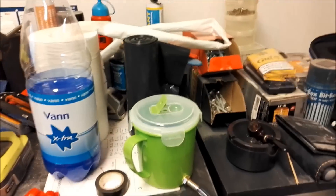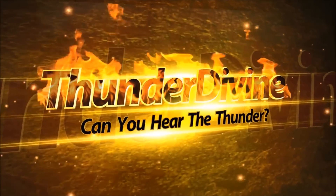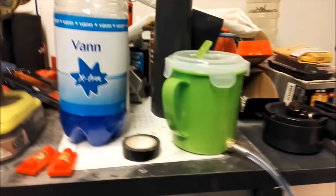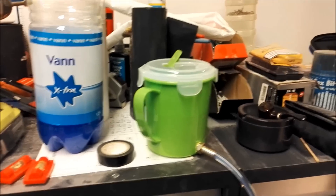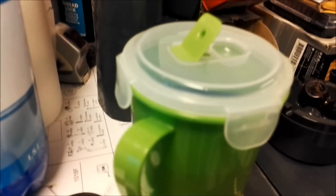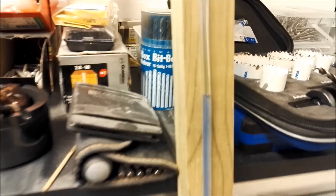The beauty of physics and water. Back to basics with the water level. As you can see, a simple do-it-yourself kit: clear tubing, a standard brass fitting — you don't even need a fitting, you can just drill the hole tight in the container of your preference. You can even use an empty bottle. I recommend using some blue or purple dye so you can see the level clearer.